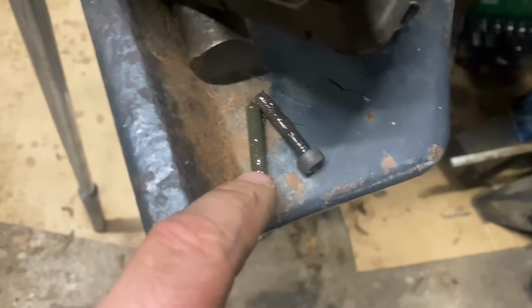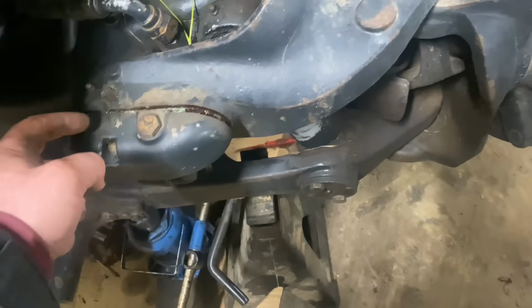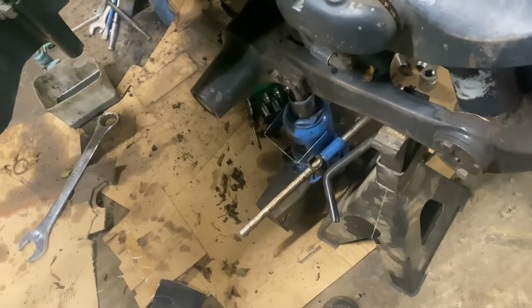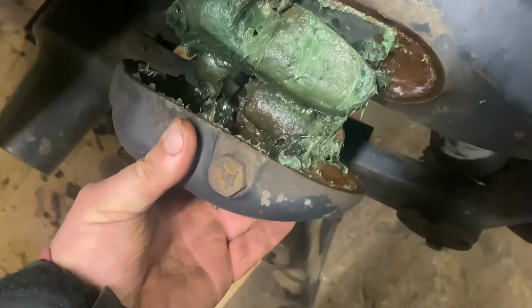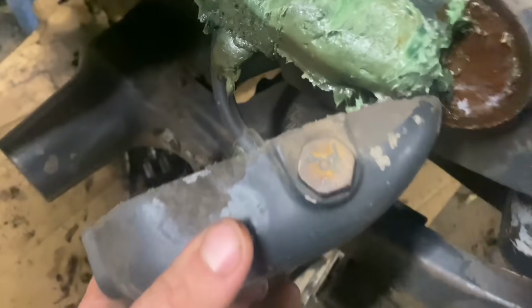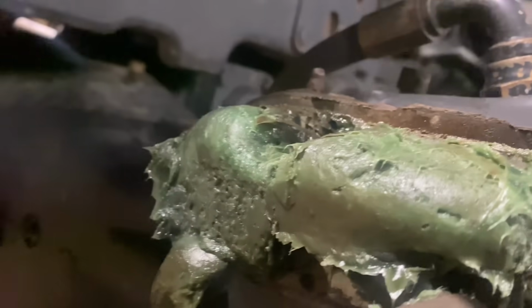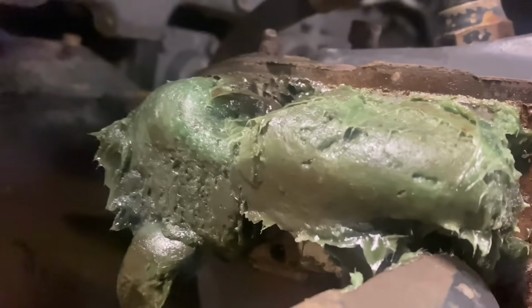A new hose and get it crimped or what I'd have to do, but I'd have to do something with it anyway. But anyway, when I took out the two bolts, I noticed they were very oily looking, and normally there wouldn't be much oil there. There is a seal to stop the grease coming out that far, but when I took it off, all that grease would come out through there, so I'll have to clean all that off now before we go any further.